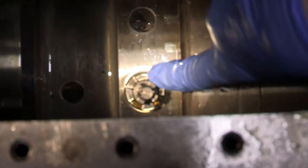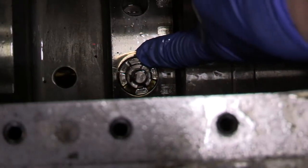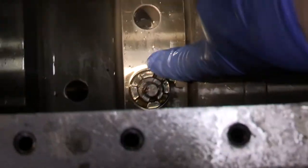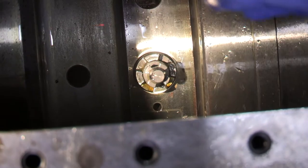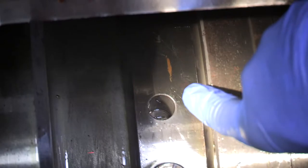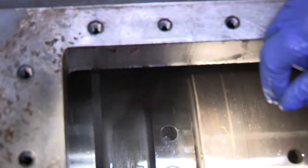This is where your clutching tool connects - you can see the two sets of teeth. The first set you go past and then give it a slight twist to engage with the bottom set. There's a spring depression where you have to apply pressure. The port right up here gives you your indication of either clutched in or clutched out. If you can't read it - sometimes it fills with oil - stick your little finger in to squeeze the oil out. It should read either 'in' or 'out' depending on the position of the clutch.